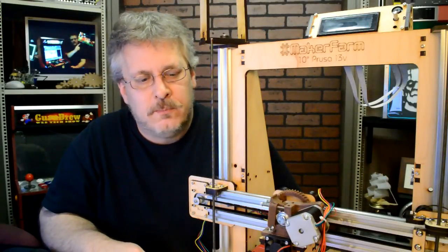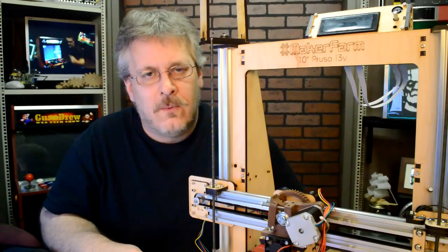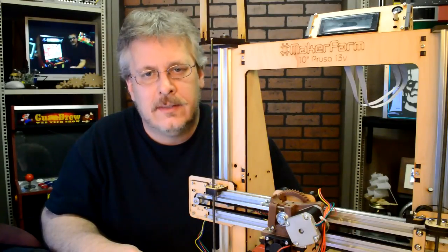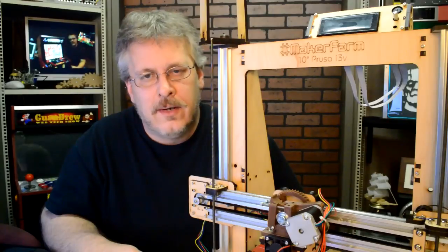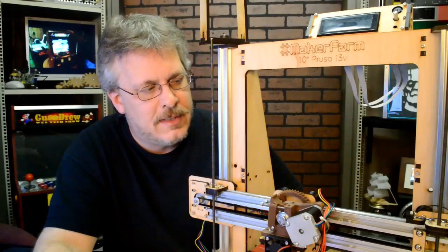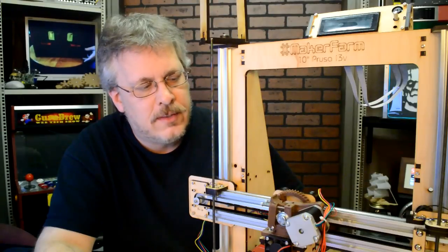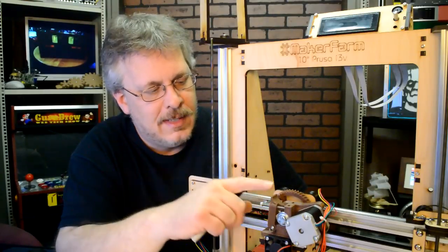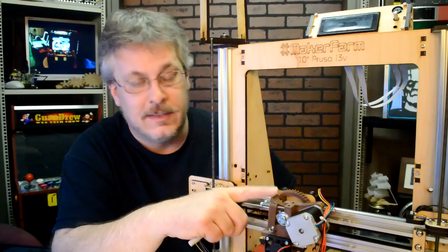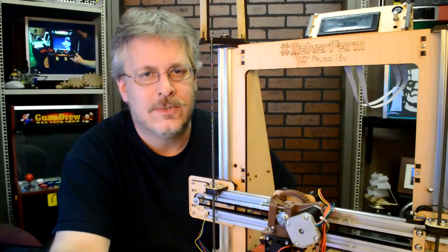Thanks for watching. We've got a lot of wiring left to do and I've got to get the power supply in. I originally was going to use a 500-watt computer power supply, but after reading I really need a full 350 watts just on the 12-volt line, and I'd have to bridge the two rails together to get that — I didn't feel comfortable doing that. So I just went ahead and bought a dedicated power supply; it'll be here in a couple days. Once the wiring is wrapped up I'll show you the features and go through all these parts and tell you what I think of them. Leave your comments down below, and we'll see you again.